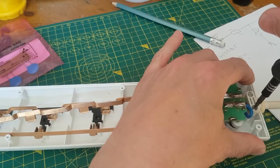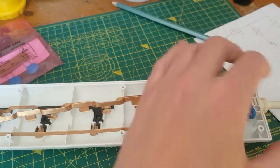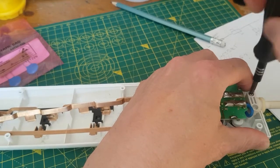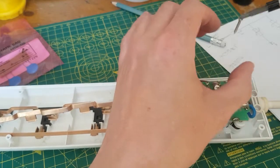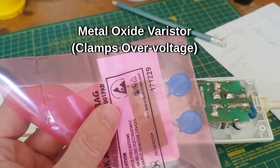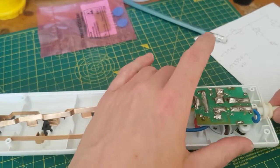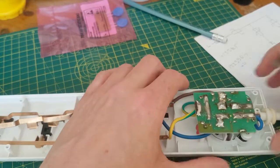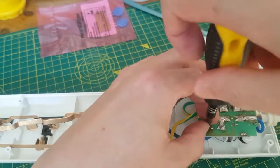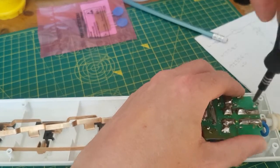The reason I'm repairing this is it's a good unit and worth saving — I'm not an expert but I think so. It's got a gas discharge tube. A lot of other ones don't have that; they just have three MOVs between live, earth, and neutral. The idea of a MOV is they're kind of like sacrificial over-voltage or over-current protection. If there's a surge down the line — which can be from lightning nearby or even running a motor in the house inducing spikes back into the line — the MOVs absorb that.